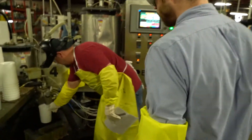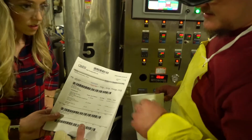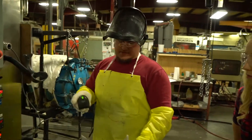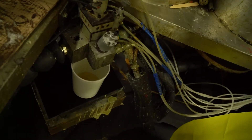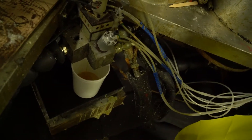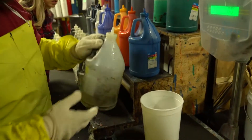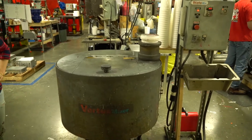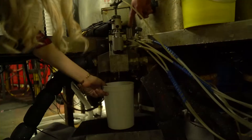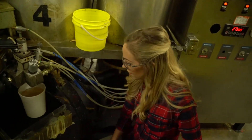Now that we know how to pour the mold, Mike takes the team and shows them how to prepare the mixture — first by scanning the work order, then selecting the mixture to be dispensed. Once the mixture is in place, the team has only 30 seconds to get the degasser and coloring into the mixture before it needs to be placed into the vortex mixer. The team takes over for Mike but quickly realizes they are still far from producing a perfect mixture.